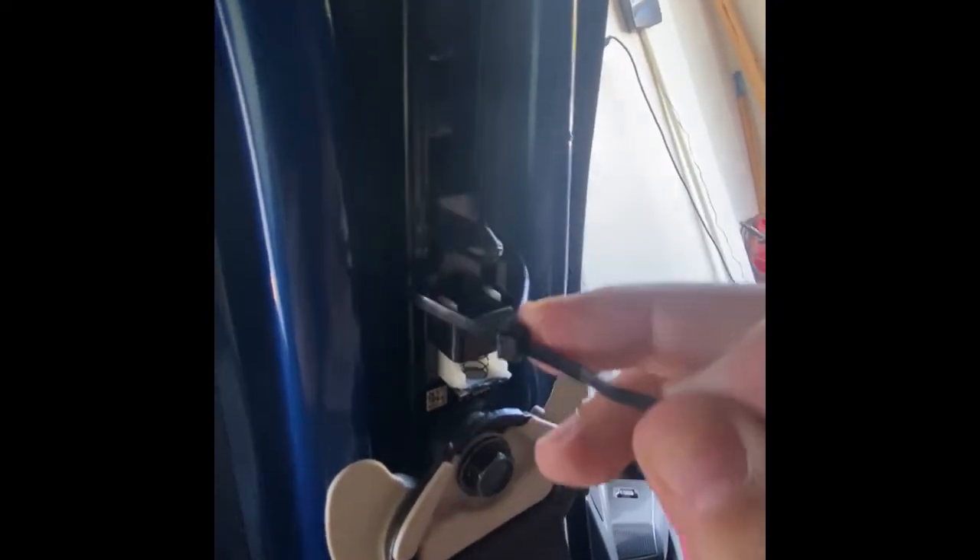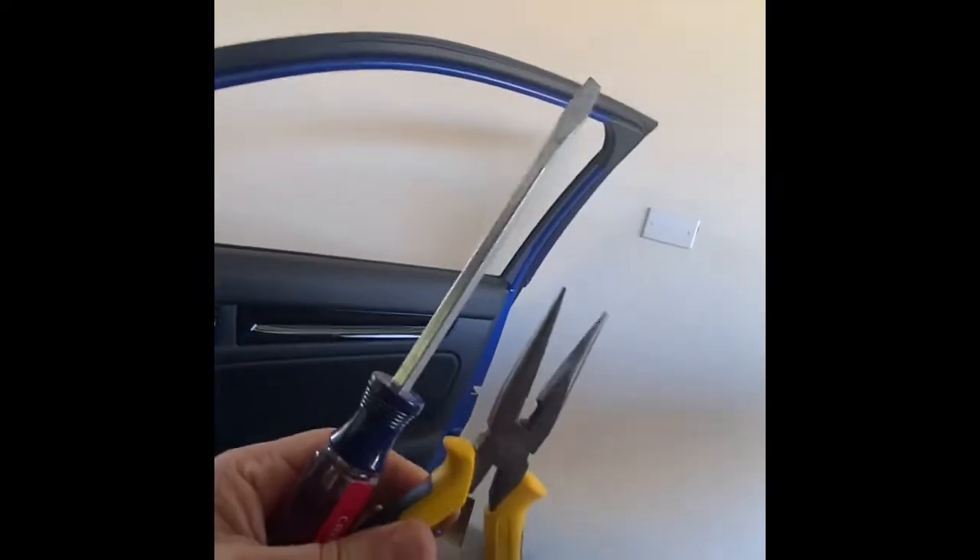It's probably what's making the rattling sound. So you take your zip tie here and route it through about right here. Now there's no play. What I'm going to do is take my screwdriver, hold that piece there, and pull on it with the needle nose pliers to make it really tight.